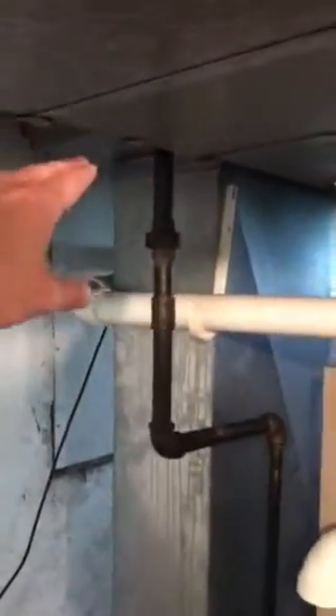If we do the full system, we'll replace the return drop from the bottom of the ductwork down, a five-inch media cabinet pulling into our side return. The furnace can come out through the walkout in the basement, same thing with the air conditioning coil. Our refrigerant lines run up — it is an unfinished basement, but the refrigerant lines are sized properly so we can flush them out.